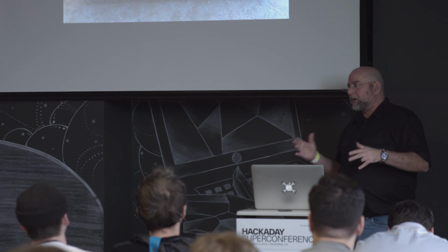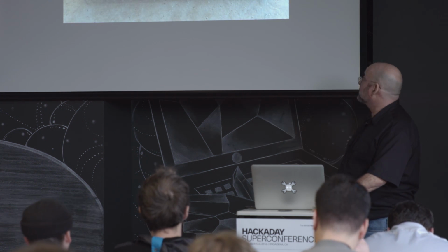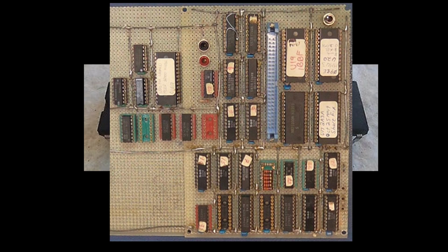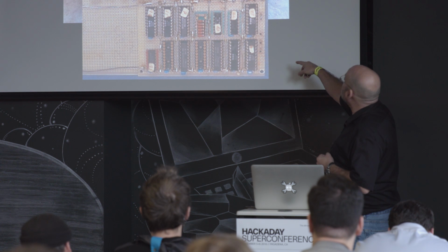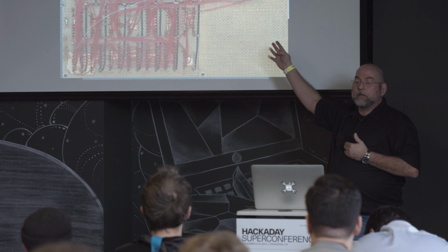This was almost the first MMU in a home computer, but I missed a bit called the supervisor bit. So we didn't care about being in the record books. We just wanted to get this stuff done. But the problem with doing custom chips, we've got 5 months to get done. Well, I can't wait for a custom chip to be done for the programmers to start. So for every chip we did, we had to do an emulator board. So we would design the chip twice, right? The chip designers are working. I did this one. And this is what they look like on the bottom if you thought wire wrap was easy. And this is how we got our programmers. We're now down to 4 months to go. And we've got like an emulated MMU.